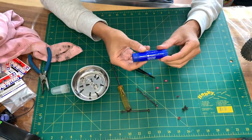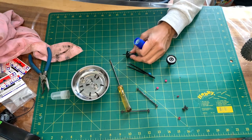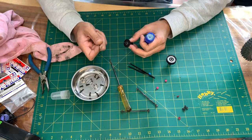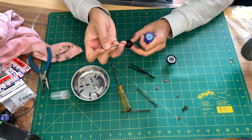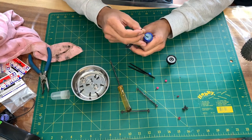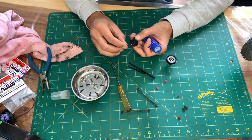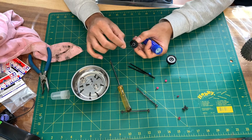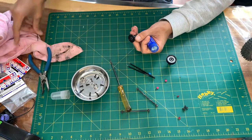Okay. Permatex. I don't like to dip things in there, because I don't want to introduce foreign oils in here, as little as I would like to introduce foreign oils into my thread lock as little as possible. So I'll just take something semi-clean, wipe it off a bit, dab some of that thread lock, and just turn it on the threads. Rub it into the threads, that's what I like to do, otherwise it'll just get stuck on the outside of the hole. That should be good.